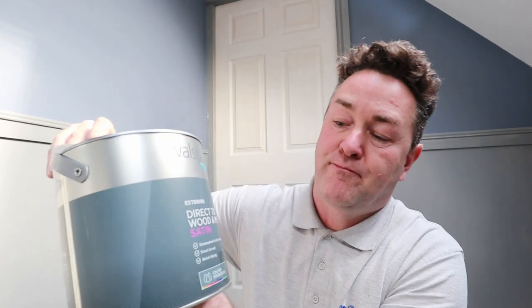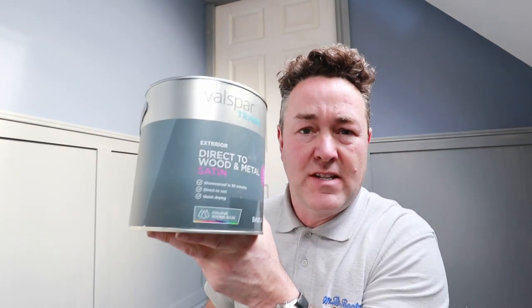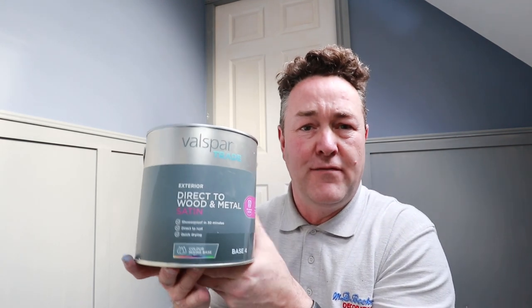Last time you saw me, I was telling you I was going to be undercoating all this in the dark grey Valspar Trade acrylic water-based undercoat primer. So I've done that, gave it one coat over that white base, well, 1, 2, 3 that we use, 1, 2, 3 plus. And now we're going to give it a coat of, I know you're gonna laugh at me, it's the exterior. I know it's all that I was given, but exterior, and it's direct to wood and metal, and it's a satin finish.